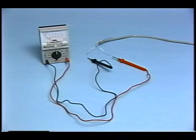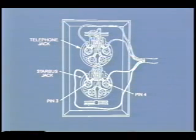If Starbus is installed over existing wiring, check to make sure there's an unused wire pair. For installations requiring new wire, use 22-gauge telephone wire, which will support the greater distances some users require to expand their data intercom between buildings. If a wire pair has in excess of 0.3 volts DC or 1 volt AC, the pair is probably in use. It's a good idea to check continuity at the punch-down panel using a signal injector or an intermittent voltage source.